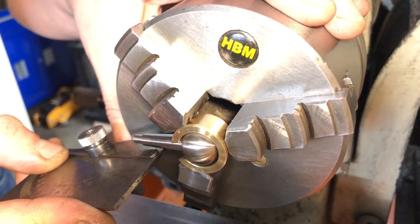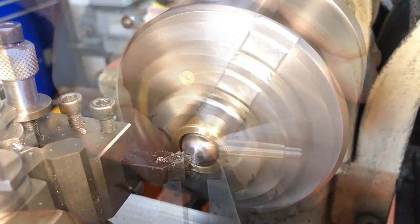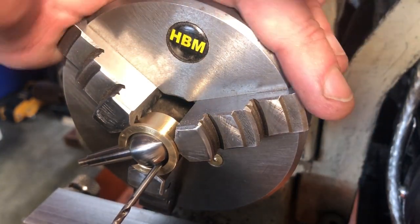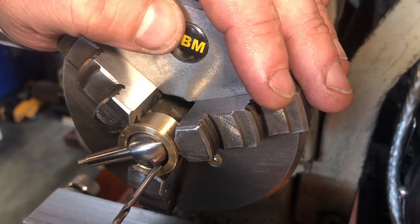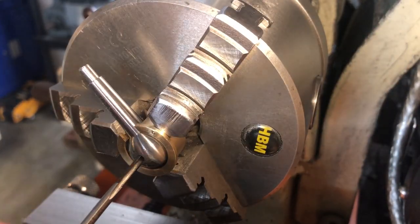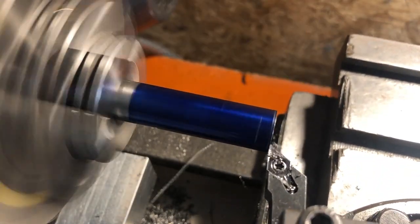I can turn my attention to machining the bottom of the main ball. The collet design here allows the handle to pivot backwards. I am just setting this by eye, sighting the spigot against the protractor held against the chuck body. The ball can then be faced to size and drilled and reamed for the threaded shank. Finally, this part requires a grub screw through the side to fix the thread. I am just using a drill bit of the appropriate size to ensure the flat is parallel with the lathe axis, and setting the shaft square by eye. I can then centre drill before drilling and tapping M3. Ensuring the centre drill is deep enough to leave a chamfer finishes the hole nicely. That's all of the work on the handles complete, so it is on to the threaded shank.